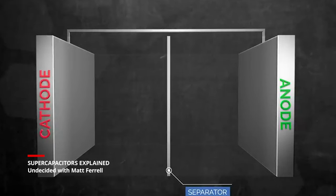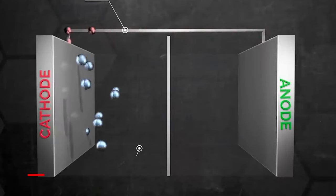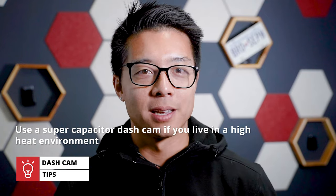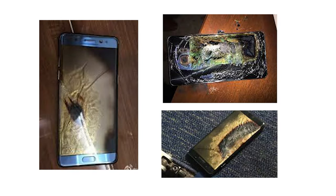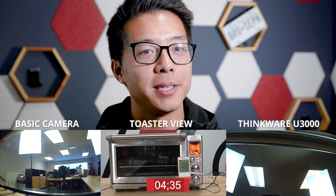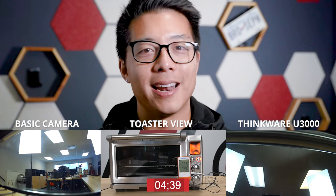Now as for lithium-ion, that's just what's in this cheaper camera. Lithium-ion batteries do offer high energy density and a longer overall lifespan, but they are sensitive to higher temperatures. If you give a lithium-ion dash cam prolonged exposure to elevated heat, it can lead to performance degradation, reduced capacity, and safety risks. If you remember that controversy about the Android phone exploding, that was due to defects in the lithium-ion battery. That's why we talk about super capacitors so often, and it's definitely something to look out for when you're picking up your own dash cam, especially if you live in high-heat environments.